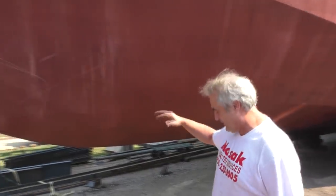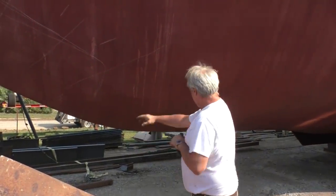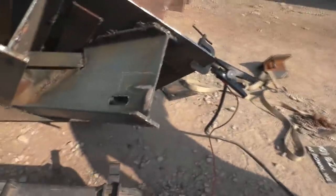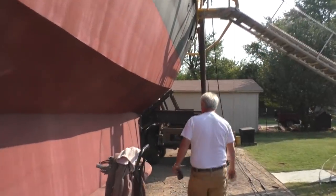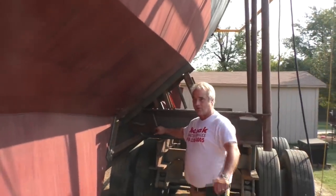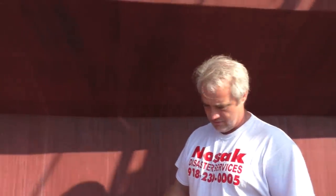Doug, I think that if these three points are your fastener points, I'm concerned about this pulling out. Okay, or right. Having give. You want something lower. Yeah, I would like to see you anchor something to your fifth wheel and go clear back to the trolley, a chain. Put a shackle back here and run one chain like a guideline. Yes. Right through there with a hole. Yeah. Put a shackle, and that way, number one, it's going to tie this together, which that's not essential, but it's going to keep that downward pull, you know, and keep it straight in line with it.